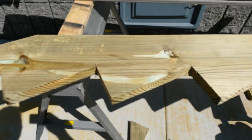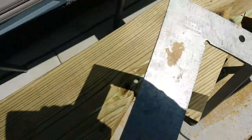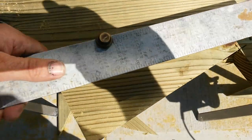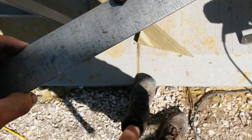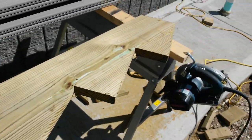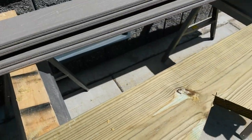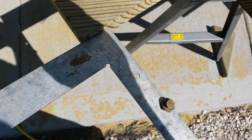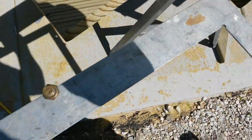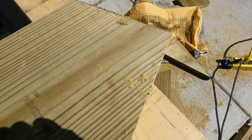Here's the finished stringer - I'll show you how I did it. I used these stoppers on a framing square: I put this at five and a half inches, then this one at 11 inches, and that's how you scribe it all the way down to get your stringer layout. At the end I had to take an inch off because this step will get decking on it and this one won't, so I make all of them the same and then cut the angle up at the top.